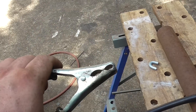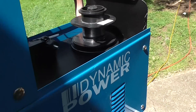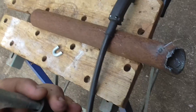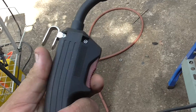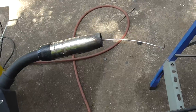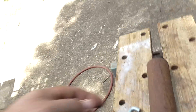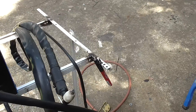The clamp is reasonable — not great, you can see it's starting to bend now. But that's the original wire that came with it — a five-kilo spool — and it's done a lot of work. The grip is really nice and comfy, the trigger's really responsive, and it's got somewhere to hang which is handy. The tip literally just pulls off and is quite easy to get to. The top locks down and you've got adjustable tension for how tight you want to feed the wire. You need it cranked down pretty tight as the cables do twist up, and it has jammed up on me a couple of times.